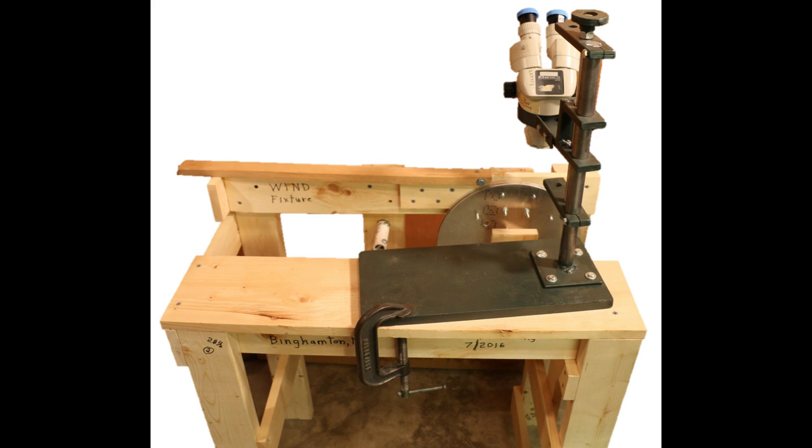The long wooden slim stick at the top, the wire would pass through it up close to the mandrel, and by moving the handle that's on the left back and forth, you can actually steer the wire into the right place on the mandrel as you turn the mandrel with your left hand and watch where the wire is going through the binoculars. Not shown, you would need some very bright light right on where the wire is on the mandrel while you're watching it. Otherwise, you can't see it with regular light.